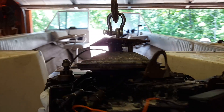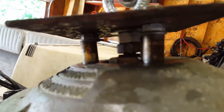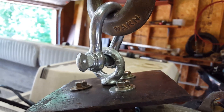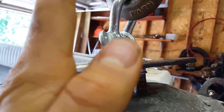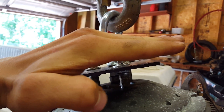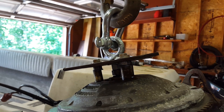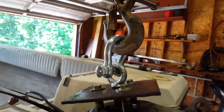On these eyes you gotta look up the lifting capacity, because I got it double-bolted right here — one tight and one so it doesn't back off. When it's straight up and down like this it's full capacity, but as you get to 90 degrees it's way less — you can look up the charts. It cuts the lifting capacity down by like 80 percent or something, so you've got to figure all that out and make sure it's good before you do this.